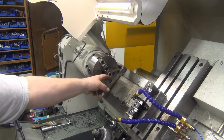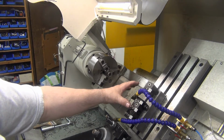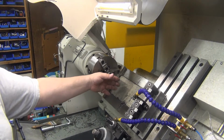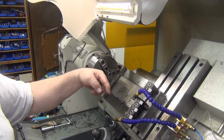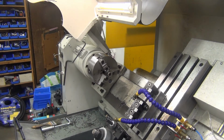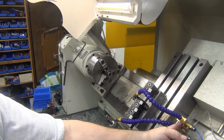But then it goes through and I copied and pasted the first facing operation to the end of the code, and then I do the same thing. I tell it go to G30, M1, then I do the deburring tool and the file, and then I click cycle start again, and that hits the M30, which shuts it all down, stops the spindle, everything like that. So it's going to make so much noise. That's why I figured I'd try to explain it ahead of time, but the mist coolant is the loudest.